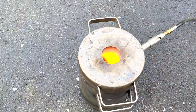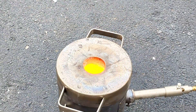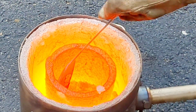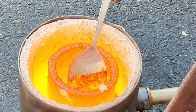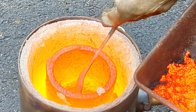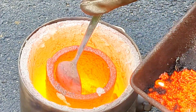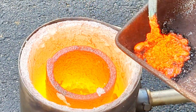I'm going to let this sit and give it a little bit of time to melt down. I wasn't really keeping track of time, but I think it's been about 10 or 15 minutes. Now I can remove any of the slag that has floated to the top from this wire — and this is a perfect opportunity for you to hear that cricket or those crickets that were bothering me the whole time. Once all the slag is removed, the crucible is clean and ready to pour.